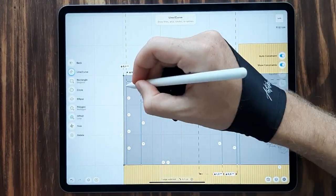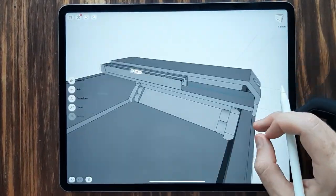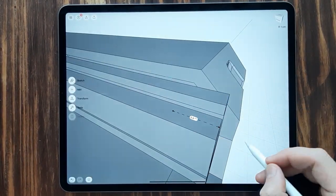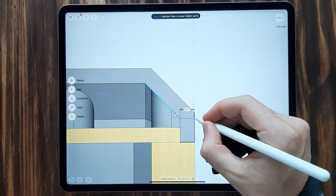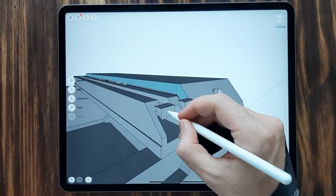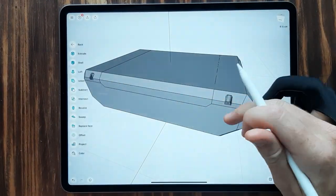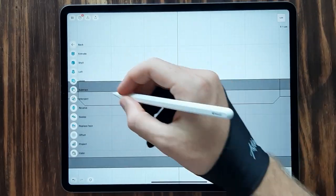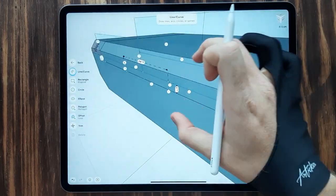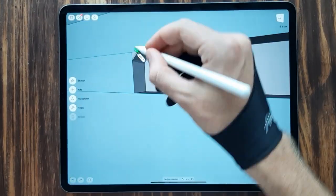As you can see, I just created the hole through which the T-shape, if you imagine it upside down, should fit in there and wiggle. What I like to do is I always give, in this case, I gave 1 millimeter of play room, because you always need this if you don't want your mechanism to just grind to a halt. And then I just use the body itself to cut up parts of this groove to make it a little bit sexier.